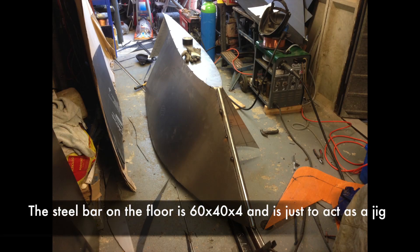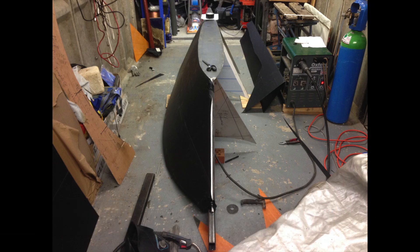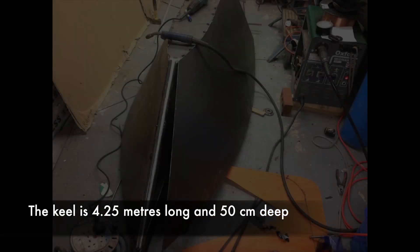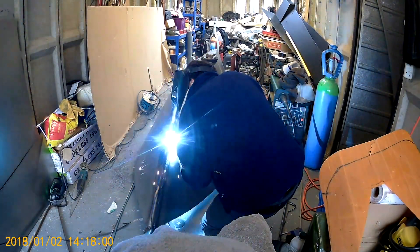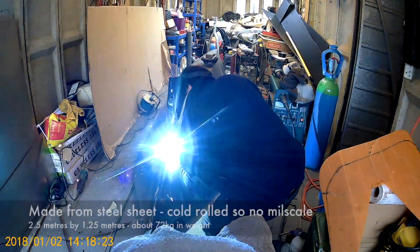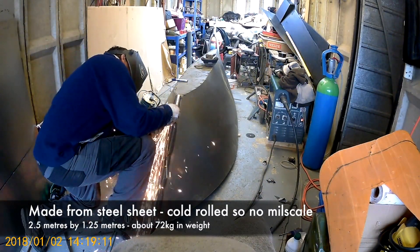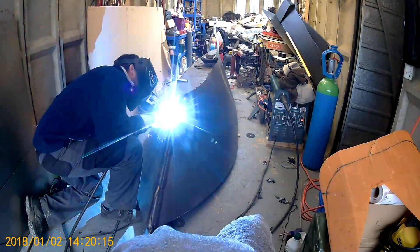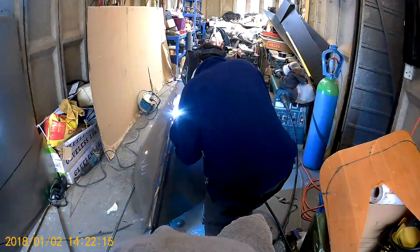I stuck it onto that square piece of bar on the bottom and started cutting the side panels. I found that they fell onto the framework quite nicely — there wasn't really any need to pre-bend them, which was quite a nice surprise. The side panels are about 4.25 metres long, so I've used 2.5 metre steel sheets with only one joint in them. I'm trying to keep the welding to a minimum because less joints means less distortion, less welding, less cost, and less risk of leaks.